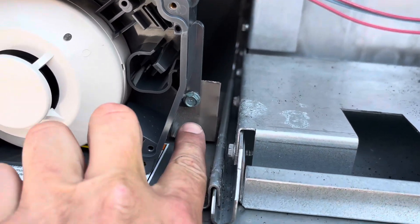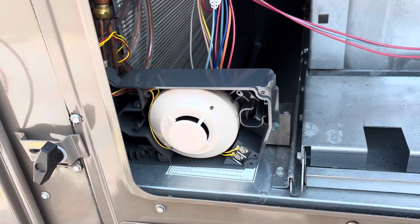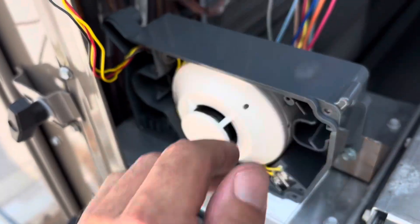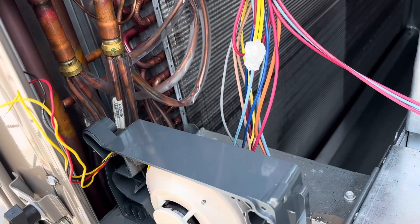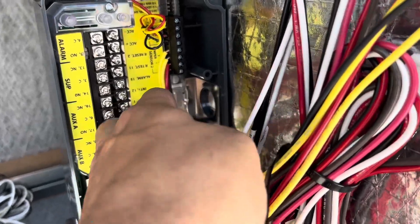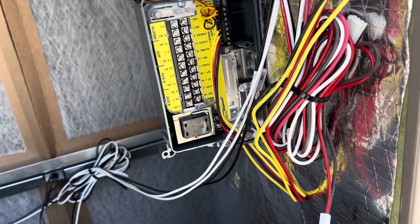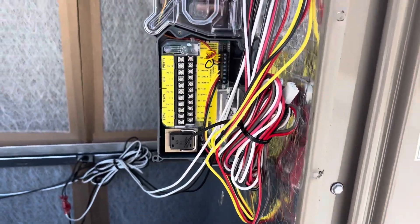It's not the best idea but it works — I cut a couple pieces of metal to make brackets so I could mount this here. I took just the sensor off, so we're going to wire it inside and put the cover back on, and then we'll just have a sensor right there. That one's mounted. Over on the other side, same deal — I've bent and cut brackets and mounted them to the wall of the unit. I already have my sensor wires on the other side connected, so now I need to run a thermostat wire inside for power and to break R on a smoke signal.